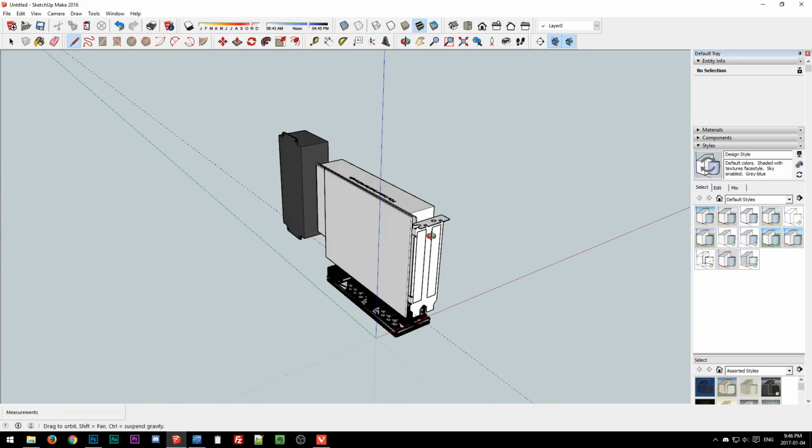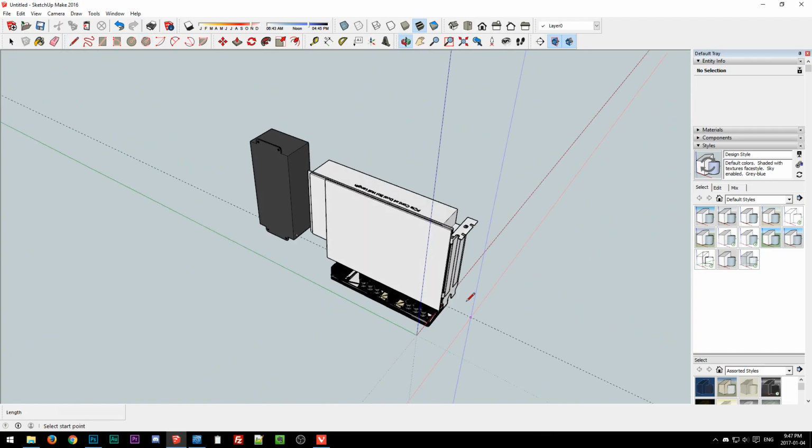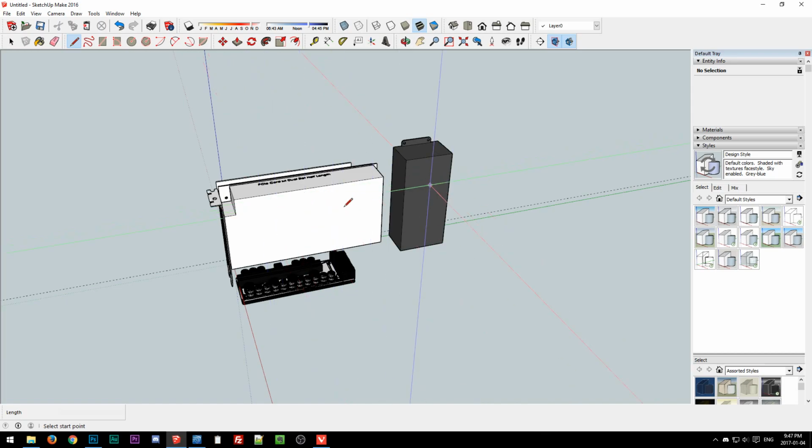So generally we would want that on a single piece of metal, because then you just have the one bend, and that will have some variance in it, which is just unavoidable. But it's better than having two different pieces, because then you have the variance of the individual pieces and then the variance of the attachment method, which if you use screws or whatever, may not align perfectly. There are definitely ways around that, but this is a real simple project. So we would probably want this as a single piece of metal.